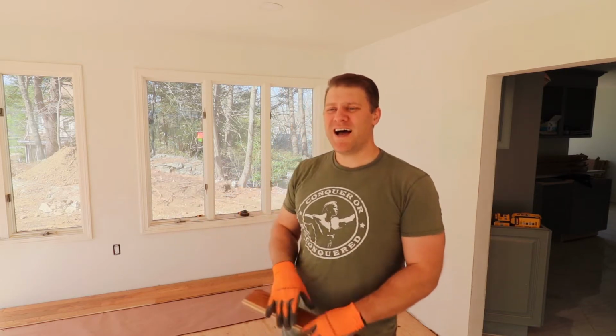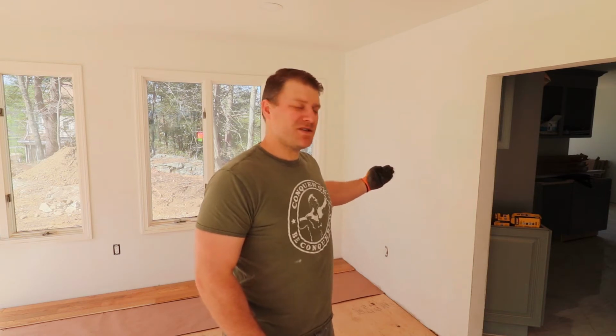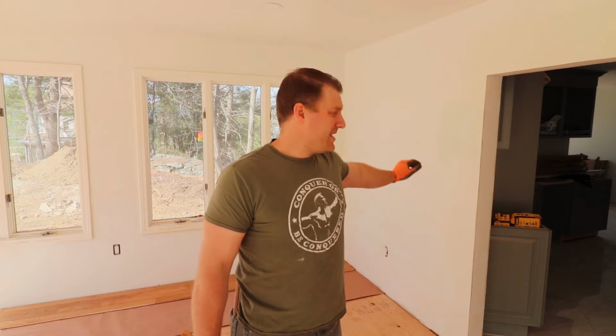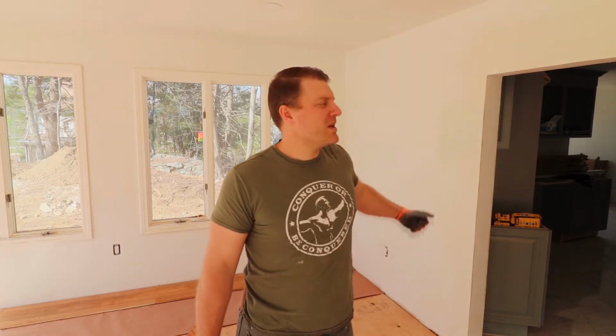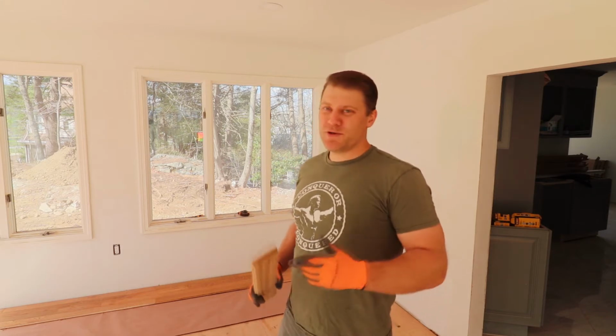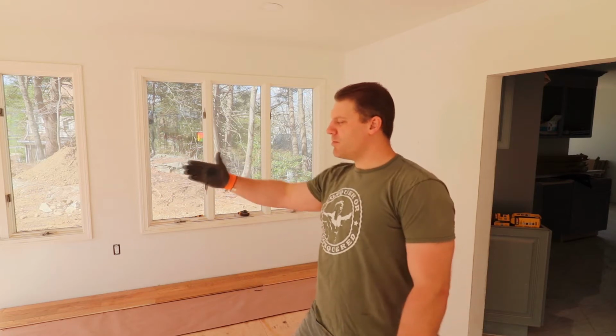So I came up with a layout that I call a 2x2 layout. The only way for us to hide that 6-inch difference in this wall was either build this wall out further, another 6 inches, to make up the difference in the length of that wall. That, though, would mess up this door frame that's going to be going in. So you'd have an additional 6 inches, so the casing there would have to be almost 12 inches wide with a normal 5.5-inch casing. That would not work. So what we decided, I should say I decided, I showed it to my wife and she okayed it, was I can hide that 6-inch difference with long runs going this way.